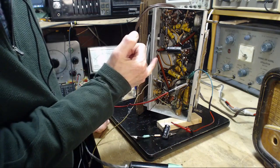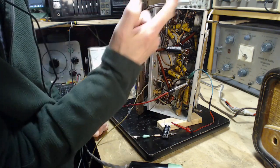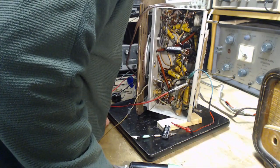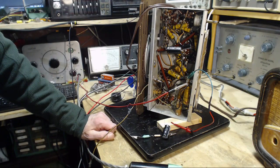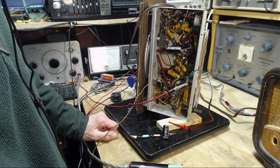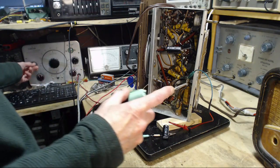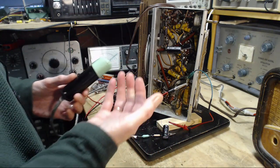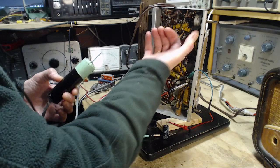There it is. I've been looking at this connection for a long time and I have not seen a wire connection that's there. That's the wire that goes to the center tap of the output transformer. Humming like crazy and not sensitive to the volume. Still on audio. It could be the hum is introduced close to the output tubes, but it's going everywhere.